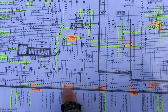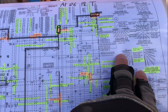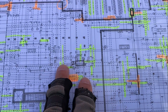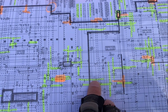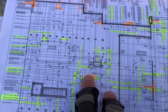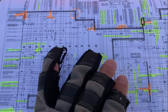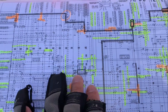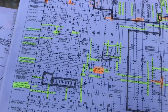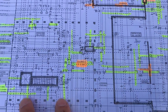Let me quickly show you what I've got on the steel drawing. I mark the columns in orange where the shear links are going to come - all explained on the drawing with how many links and what the distance is. I highlight the additional bars - there's a big extra rebar here that I want to make sure is in. All the rest of it, bottom and top, is typically 12mm and 10mm every 200, so you can see it's in - you won't have time to measure everything with a tape, but you want to make sure the extra bars are in.